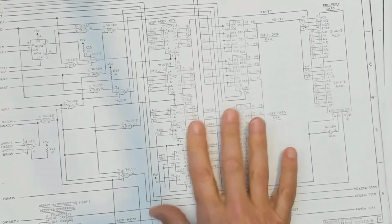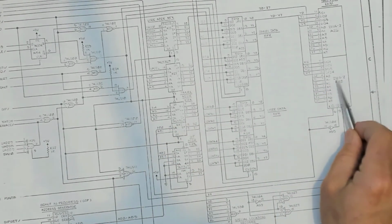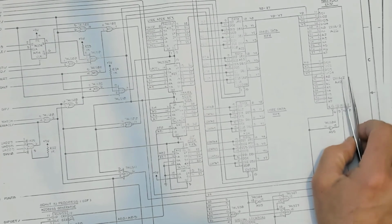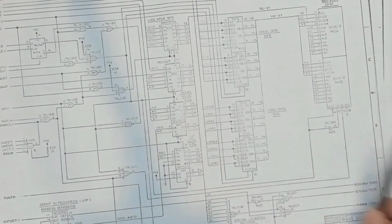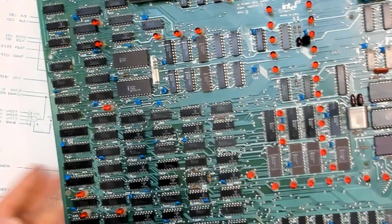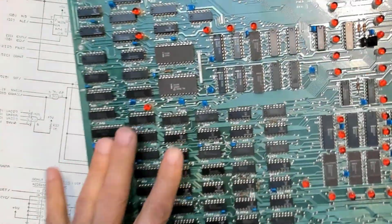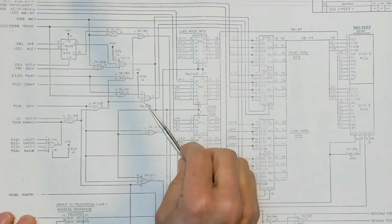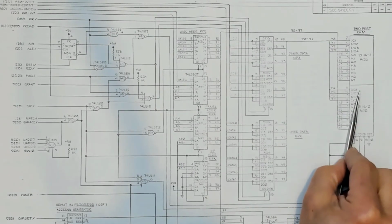At this point, you should see the desire to have a bit of diagnostics. Let's say that for some unknown reason your microscope got a problem. For some unknown reason, this block of RAM that's shared by these three devices is becoming corrupt. So to break down the problem, it would be extremely useful to know who or which process was corrupting that memory. And there's a lot of logic. We've got a dozen pages of logic here in this microscope, and you can tell that the board's fairly sophisticated, lots of gates in here. And so it wouldn't take much of an error or mistake in the hardware or in the software to corrupt that shared memory. And by breaking down that problem using these gates, you could determine which portion of the software or the hardware was causing that corruption.